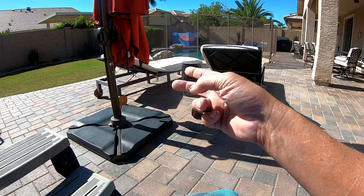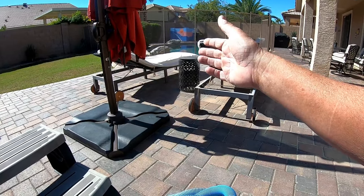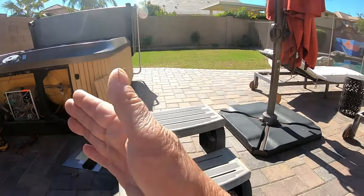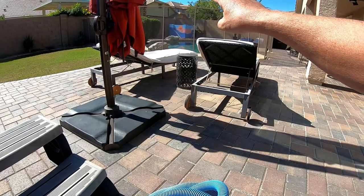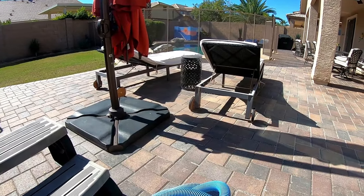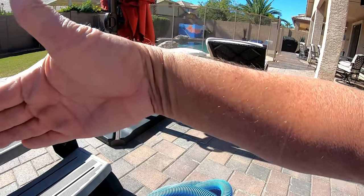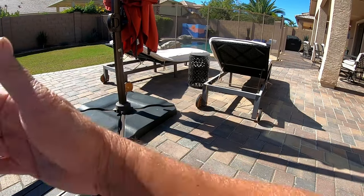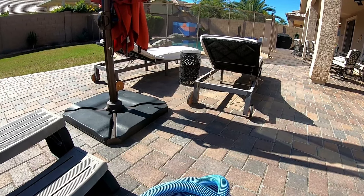Here in Arizona, there's two types of pools — one is a chlorinated pool, the other is a saltwater pool. This one happens to be a chlorine pool. It's not going to matter that there's bromine in the hot tub because you're pumping 300 gallons into like a 20,000-gallon pool — you're not going to hurt anything. Then in the end, I'll take the pump and pump it right back into the hot tub. Just be aware: if the pool is saltwater or the hot tub is saltwater, you cannot interchange the two. It has to be chlorine-bromine to chlorine-bromine — like for like.